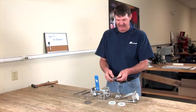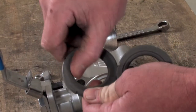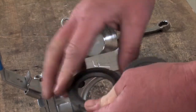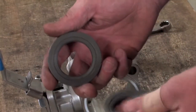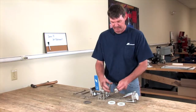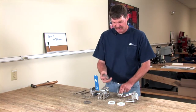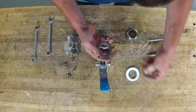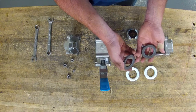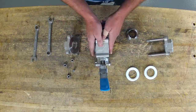To replace the seats, look at the back side — this side has a little bit of an edge on it that you can feel with your thumb. You want to make sure that you're putting this side against the ball to make sure that it seals. Examine your seats carefully, as they are commonly put in wrong.